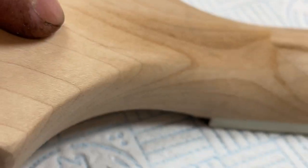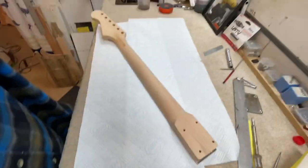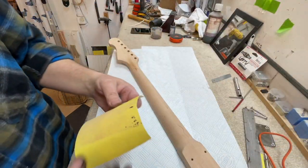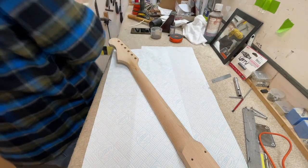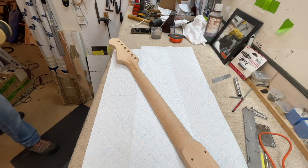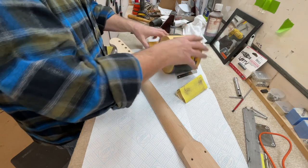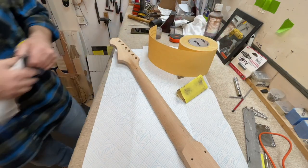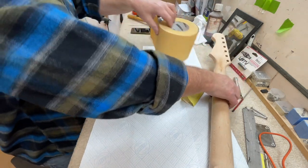Like I said, it's almost no grain. There's a bit of staining there that I want to try and sand out right now, if I can. This is 120 grit. Let's go with the lighter grit, shall we? So I want to get it clean. And then I guess I will think about what sort of stain, because the true oil will eventually bring with it a golden honey colour. But we can help it on its way and give us the requirement.